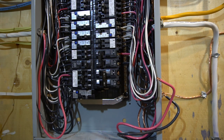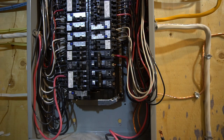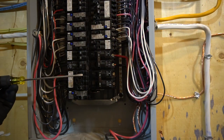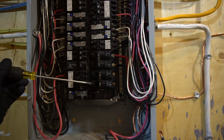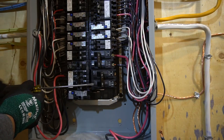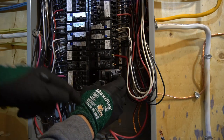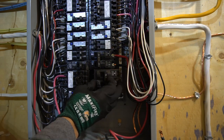Now for the next step, to take off the breaker: the easiest way is by putting your flat head on the side. There's an indent slot where the flat head fits, and you lightly pound it on the side and it pops off like this. In the back right corner is the pivot point, where it pivots the breaker.